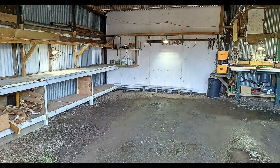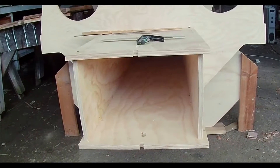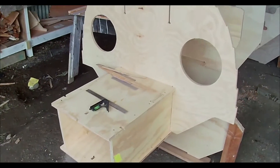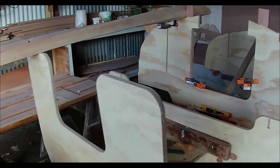To begin with, before I started building, I spent several weeks just making a space to build the boat, putting in benches and shelves and storage space to put all the timber and all the plywood components. The first job was to put together the building frame, which is assembled with plywood — there's a box girder that supports station moulds and frames that support the bulkheads, and the boat is built over the top of that.